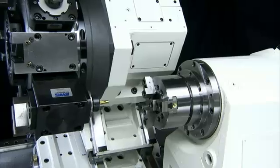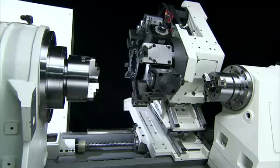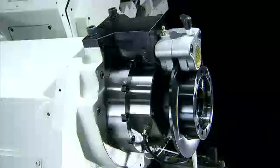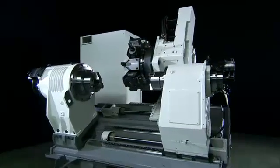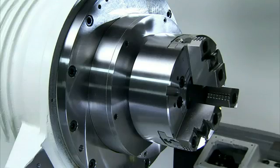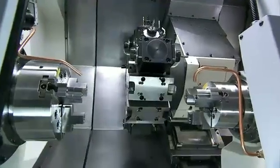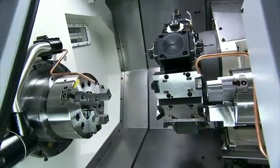The internal space design is also unique and allows for maximum flexibility in machining without any worries of tool interference. This FNL dual-speed motor-driven spindle has a unique design with the direct drive motor built into the spindle housing, avoiding the need for an external motor and belt and saving valuable workshop space. The spindle uses the very best NN-type and angular bearing for very high precision even under heavy cutting load, and features an extra-wide 77mm bore for larger bar capacity up to 65mm.